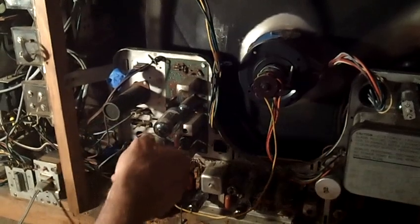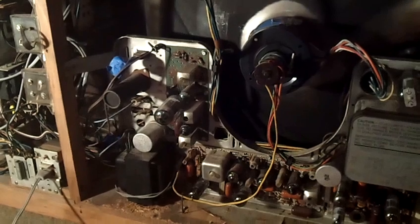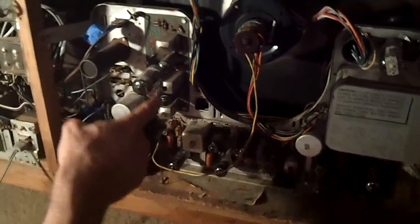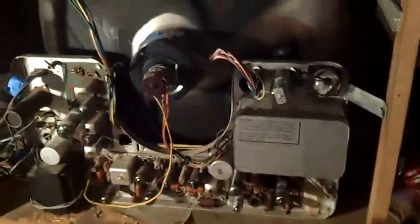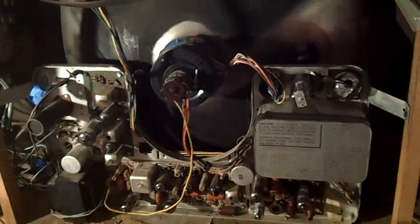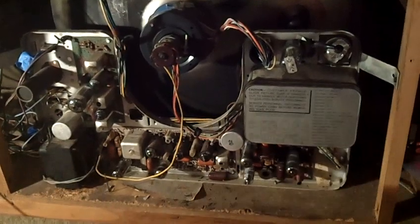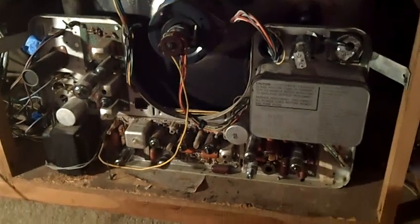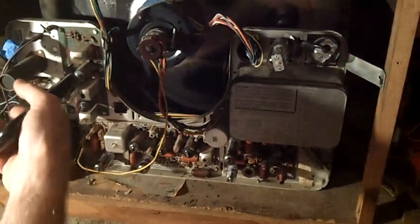So that tube is missing. In fact, this other tube in here — I think its only real function is some kind of voltage divider. Basically all it really needs is the audio IF amplifier tube and the gated beam audio detector, which is a kind of detection for FM signals used on later TVs versus the earlier discriminator or ratio detectors used on some early TVs. The gated beam tube is a lot easier to set up, it's got much higher amplification, it reduces the tube count, and it's not nearly as complex to align the audio.